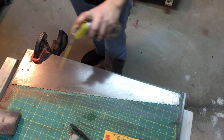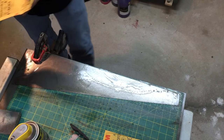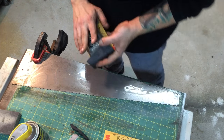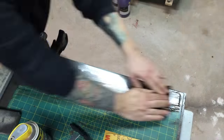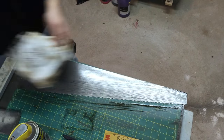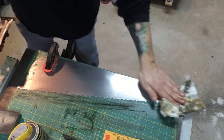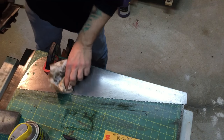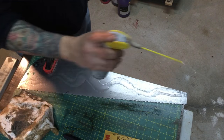Once the scraping is done, I'm using WD-40 penetrating oil as a lubricant and I'm working my way through grits of wet/dry sandpaper. I'm using a sanding block because I want it to move smoothly across the flat surface of the saw. I'm starting with 400 grit and working up to 800 then 1200. I don't see any need to go higher than that. Keep in mind this is a working saw - not an antique showpiece or collector's item restoration.